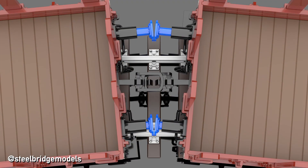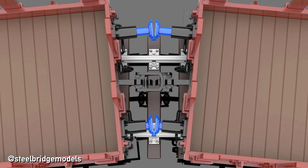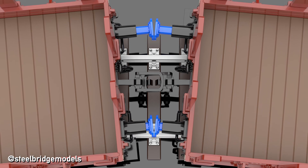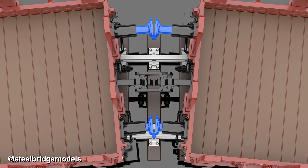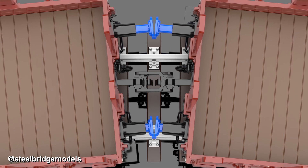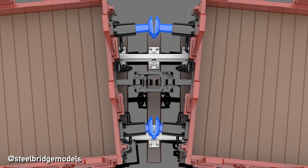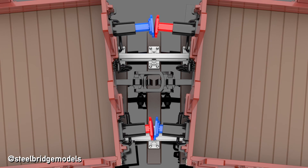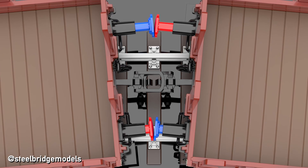It is easy to see why the use of two flat buffers is a bad idea, as already the slightest curve would result in one if not both buffers pressing against each other with nothing more than their outside edge, resulting in a lot of wear or even damaging the buffers involved. The solution is as simple as curving the buffer plates, to allow them to roll on each other.